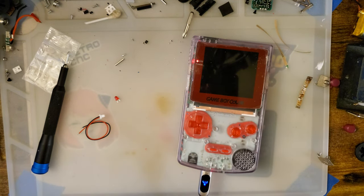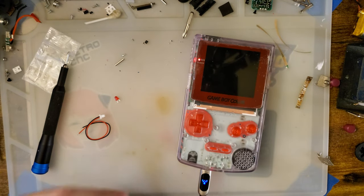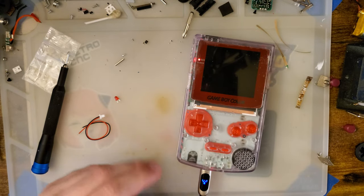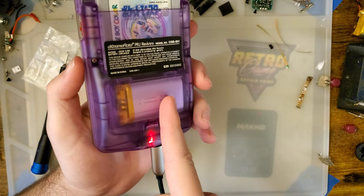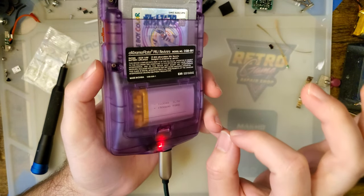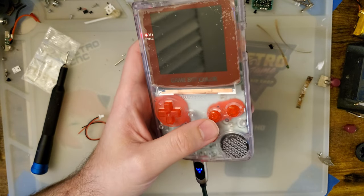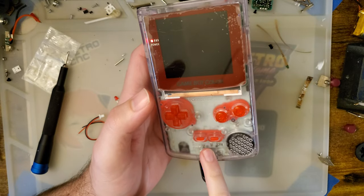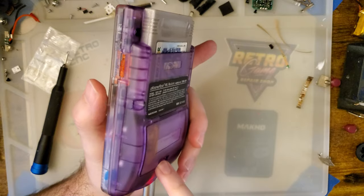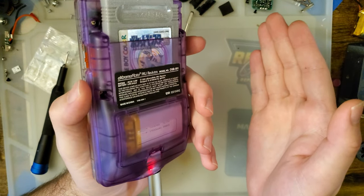It's not something I'm familiar with, not something I've used, but the data sheet is pretty easy to find. And right up top, it says it supports an input from 2.5 volts to 5 volts, which means if you drain this thing to empty, it's going to bring the battery down to 2.5 volts. That's not okay. I don't ever recommend playing with this mod until it shuts off on its own. You will have brought your battery down well past what is widely considered the safe range.